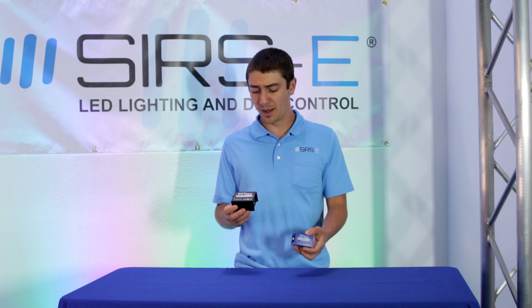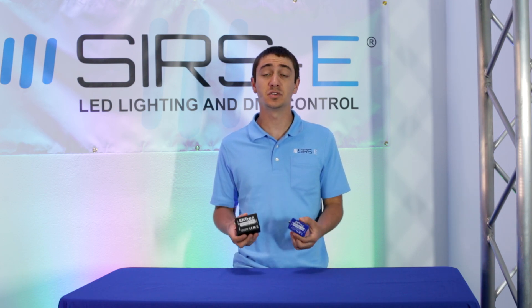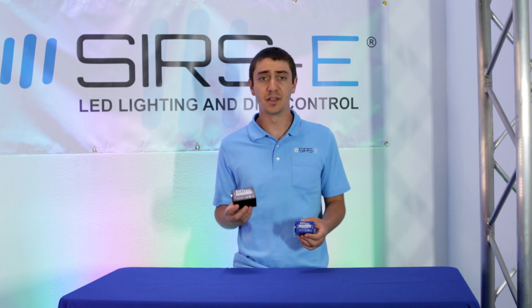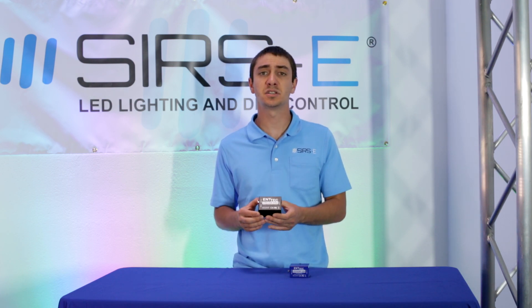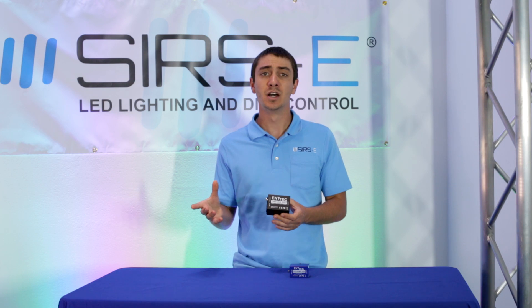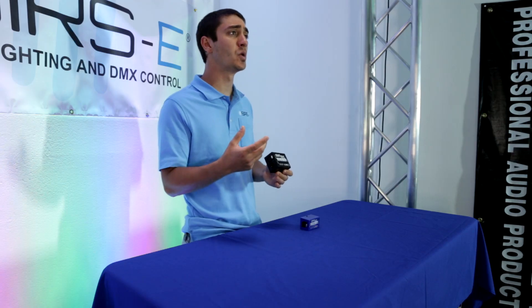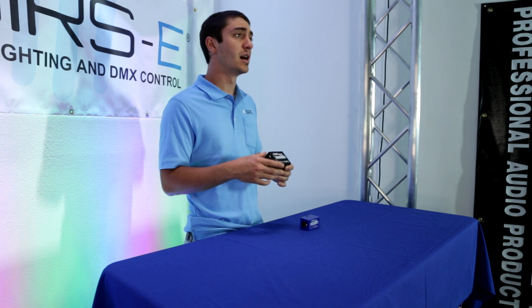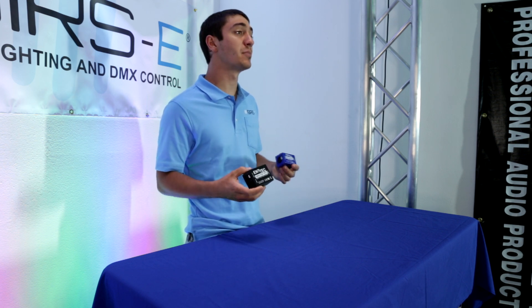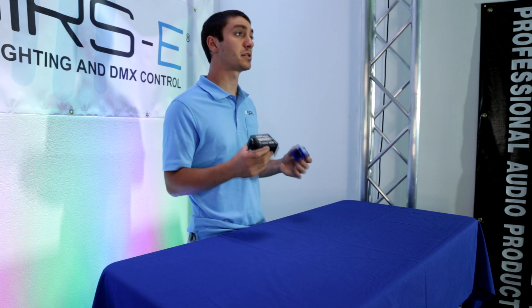Well, that's a good question. The thing is that the Pro does come with some added features that can be very useful, depending on your application. The USB Pro has an integrated microprocessor, which means that the performance of your DMX show is not going to solely depend on the performance of your computer. So if your computer is kind of laggy or slow, or you have a lot of things going on, with the USB Open you might see some lagging, some flickering, different weird things that could happen.